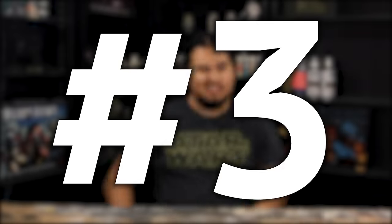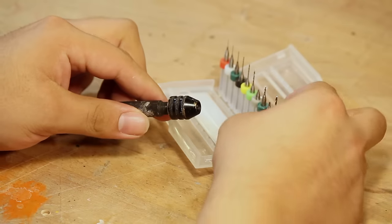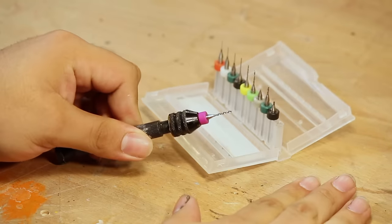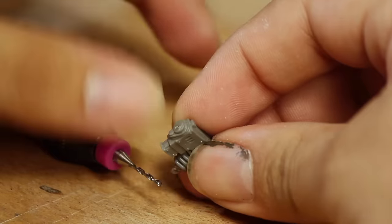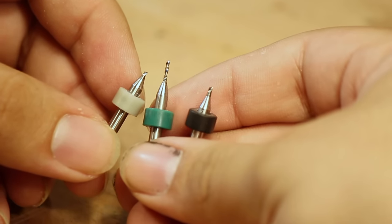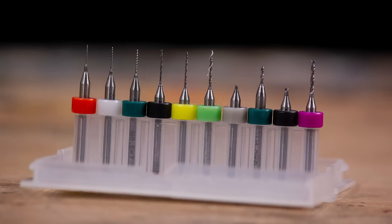Number 3: It's hard to find drill bits in sizes smaller than 1/8 inch, and a lot of the offerings on Amazon leave a lot to be desired — usually dull with poorly ground tips. I'd like to introduce you to PCB drill bits. These bits are super sharp and really hard; they will blast through plastic like nothing else and work perfectly in a pin vise. They're also great for drilling out gun barrels. Just know that although the bits are very hard, they are also very brittle — best used on plastic. Wood, resin, or metal will probably snap them.